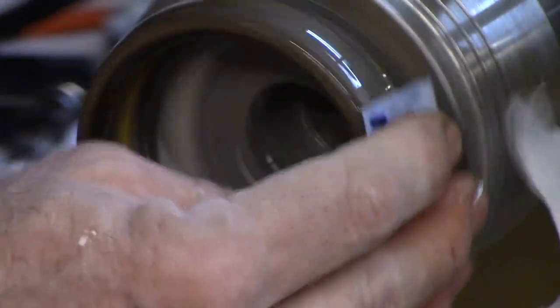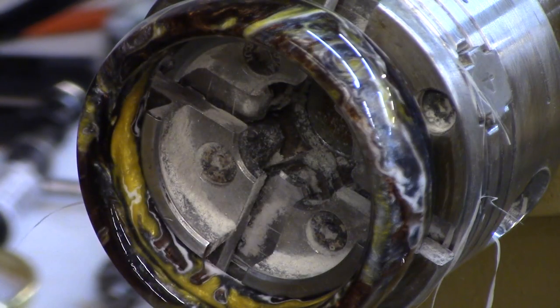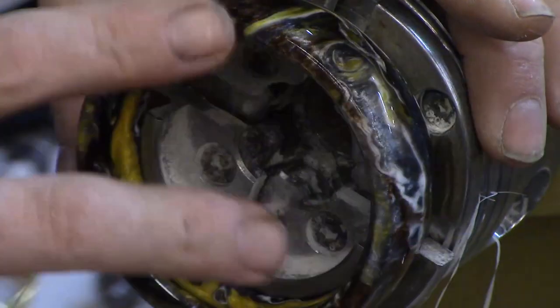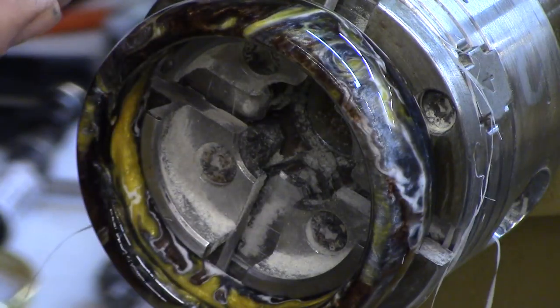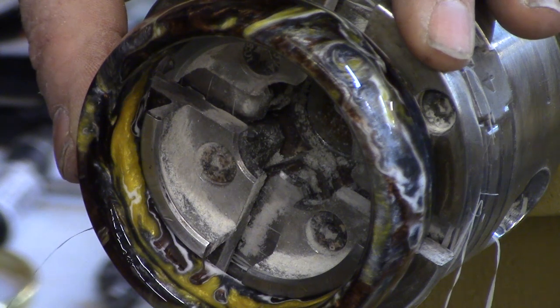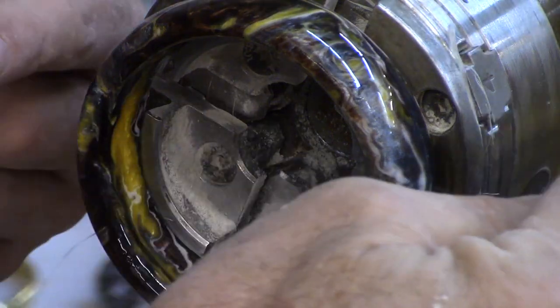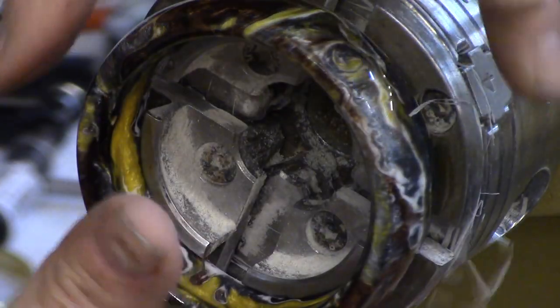What do you use to turn the pendant? Okay, so the question is, what do I use to turn a pendant? Well, I used to take two of my chuck jaws off, and I had a block that fit in it, and I would slide them back and forth, and I'd do an offset pendant with it. You can do that, but it's a pain to line them back up where you were before in your original spot. So you take two of your jaws off, now you've got a slot, and you make a 1x2, or think of a 2x2, 4 inches long, and you clamp it in your jaws.